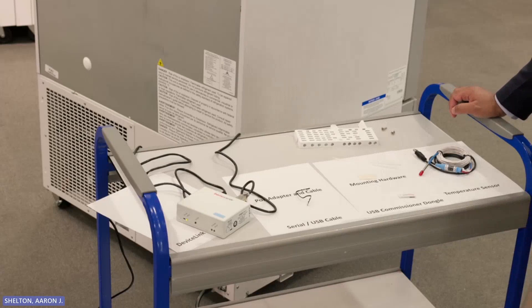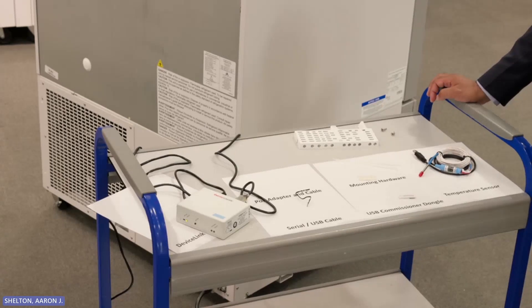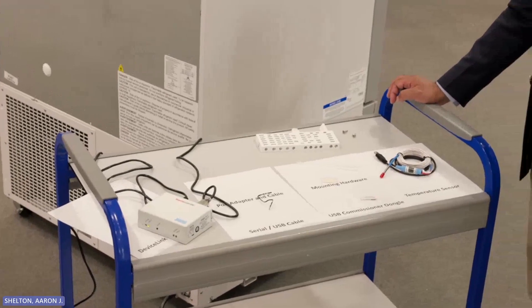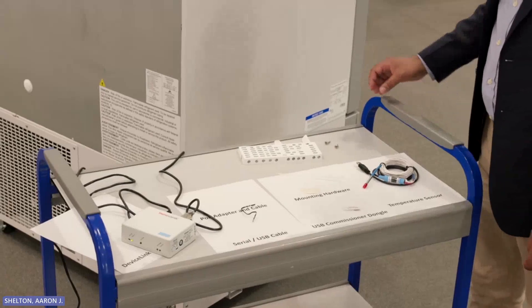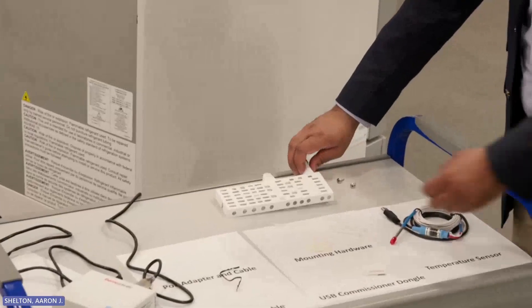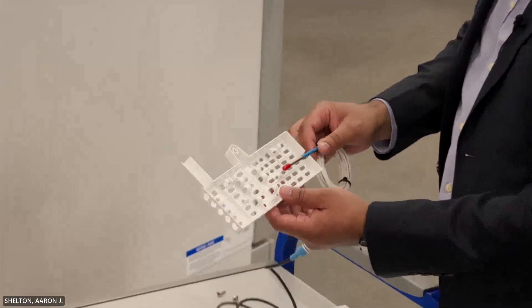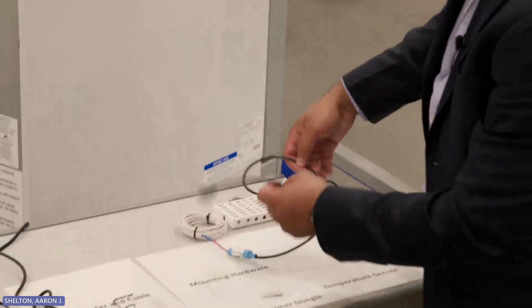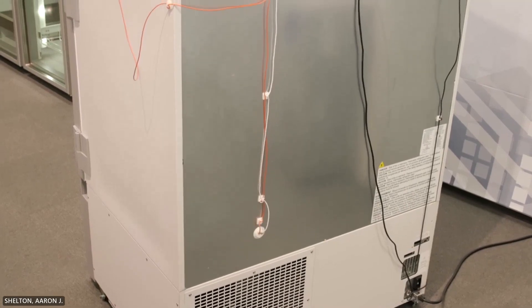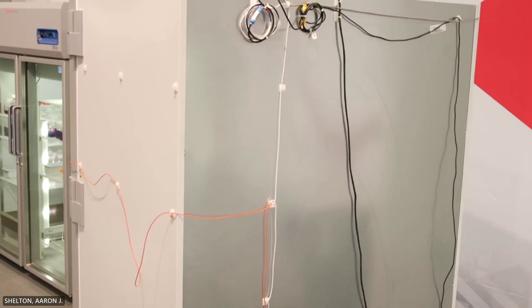We can now connect independent sensors. Independent sensors can be used either in conjunction with a system connected by a serial port, or as a standalone independent monitoring system. For this demo, I will go over the process for connecting a temperature sensor into a ULT freezer. Locate the sensor housing, which is typically located near the bottom of the freezer. I've already removed the housing from this ULT freezer. Insert the probe, then put it back into the freezer and route the wire through the access port located on the rear of the freezer. It is recommended to cover the access port using a flexible sealing agent to minimize heat loss through the port.